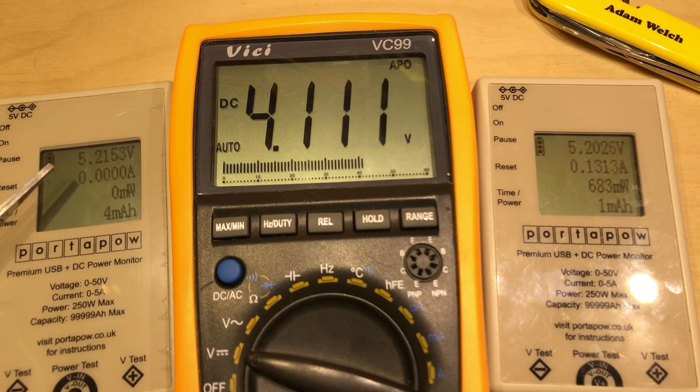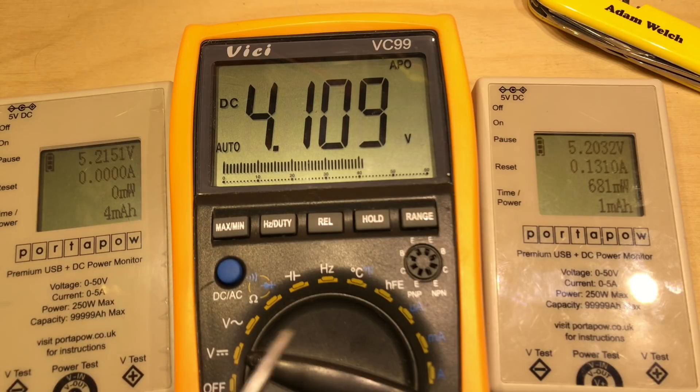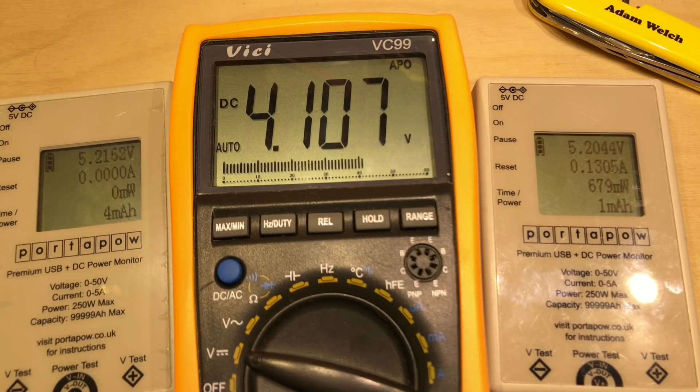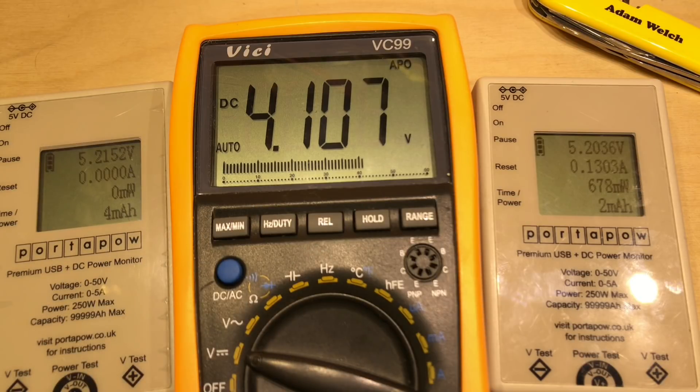Of course, as long as that external power supply is live, the UPS should be using it — but clearly it isn't. We are drawing from the battery even in a normal power situation. So when we've only got a small drain on the system and the battery is reasonably well charged, we have a net loss in the UPS — the battery is decreasing rather than being maintained by the external power supply supplying all the current to the load. So that's a strange thing.